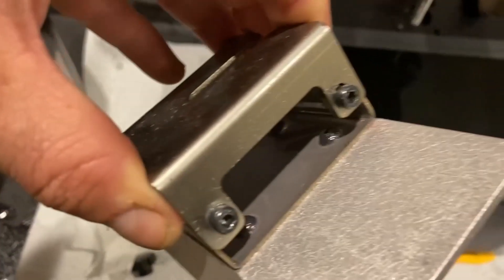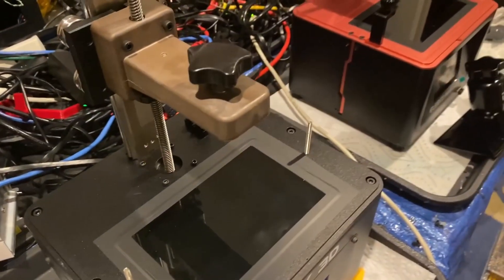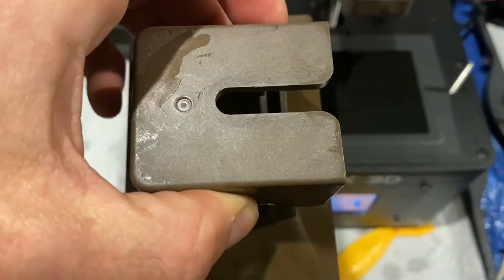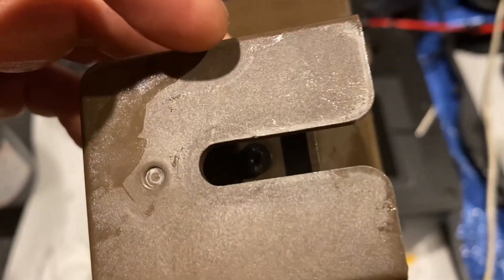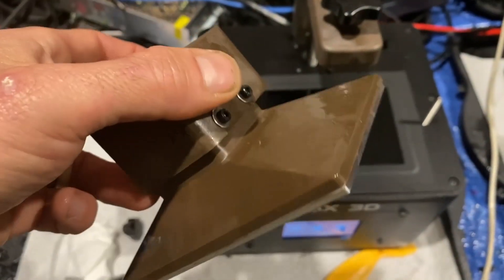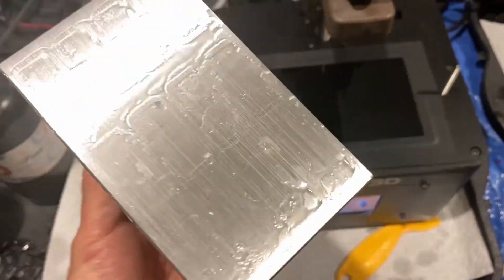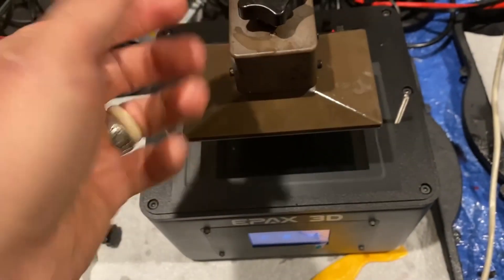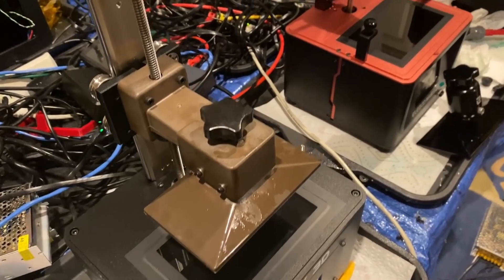I like how Epax stuck with the four-screw system. If you look at the X1, they have these four bolts, and once you set it, it never moves — and they kept that with this new system. They made this engineering plastic, like a fiber-reinforced plastic. You can put glass fibers into plastic in an injection mold to make it super strong. Then they bonded a thick machined aluminum plate to it. They went the extra step and had molds made for all this injection molded construction, which is a good idea for long-term production.